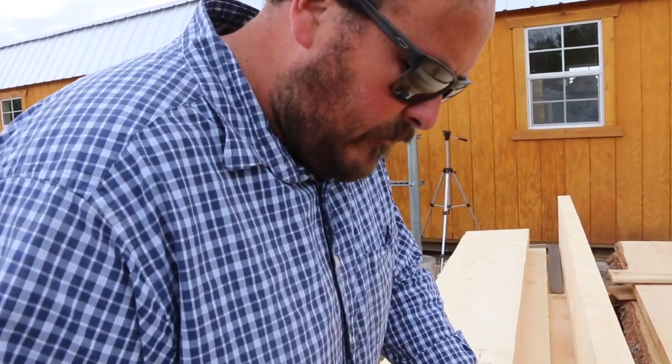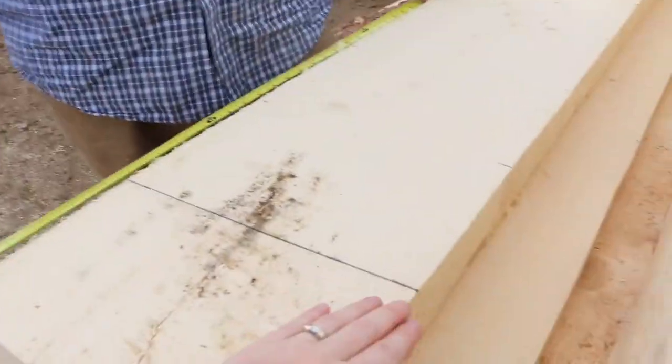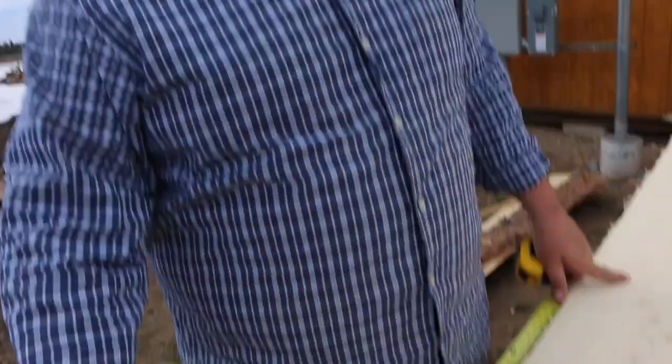I like to go back and double check my work. So I'm 7, 7. You'll match your inches, but not square to both sides of the board. Instead, you're doing square to the angle that you cut. Right, correct? Because I know that this angle is the one that's going to sit on the floor, and the floor is level. Yes. And you might find that your sawmill hit a knot, so you just want to check. You don't assume that there's uniformity. You're just not going to get the uniformity that you get out of mass production at Lowe's or Home Depot.